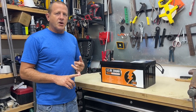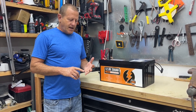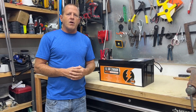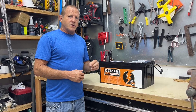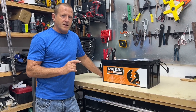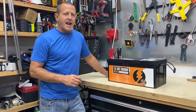Let's go over some of the specs on this. It has a 200 amp BMS — that's 200 amps of continuous discharge, really nice capacity for a BMS. It has an 850 amp peak discharge, so that's starting power for an inductive motor where you may need that initial energy to start. The BMS can also handle 140 amps of input, so if you have a high-capacity battery charger, you can fast charge that 280 amp hours.